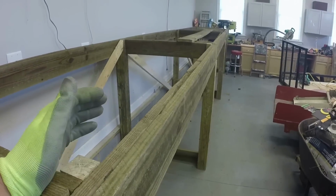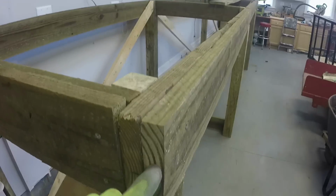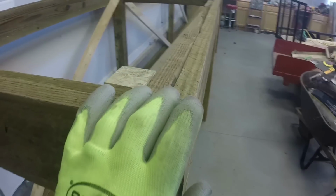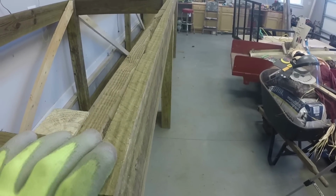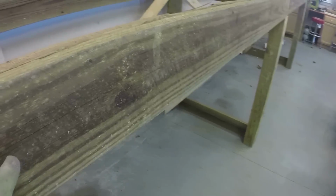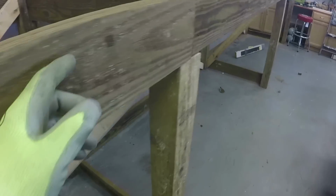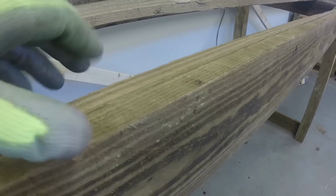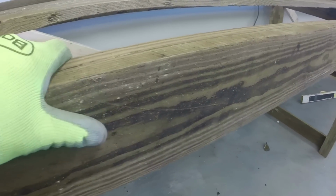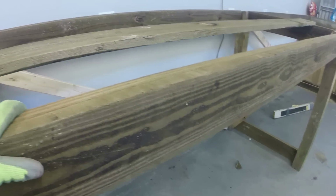This is basically free lumber to me. All this pressure treated lumber, because it was left over from a fencing job. And it's true 1x6s and true 4x4s. So I've doubled up the 1x6s, since that's what I had. And of course, they will be stronger if they're pinned together. So I will shortly here come back and put a series of inch and 5/8 screws to tie the two individual 1x6s together to basically make a 2x6, and it's a full 2 inches. So that'll be plenty strong.